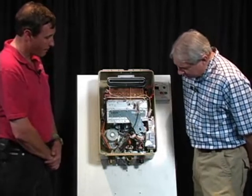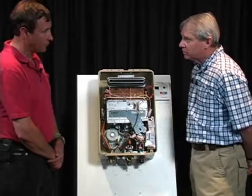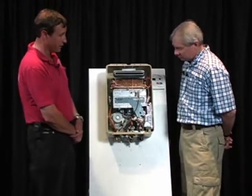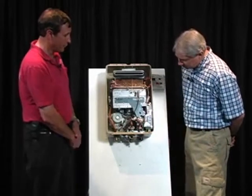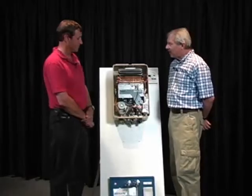So a service manifold being 2 shut-off valves? And 2 drains. Spigots that can actually be hooked up to a hose to drain the unit, and also to introduce the white vinegar flush that needs to be done every year. So an inspector should look for a couple of ball valves and a couple of drains. Of boiler drains, right. This has been good, Dave.